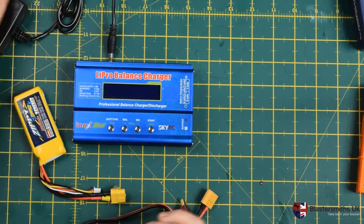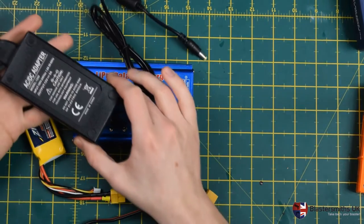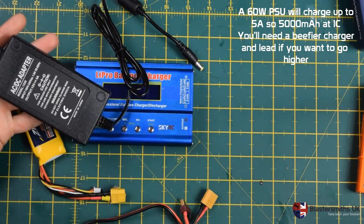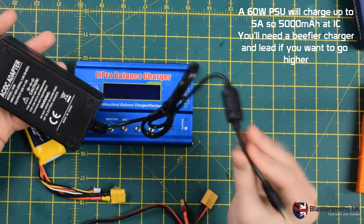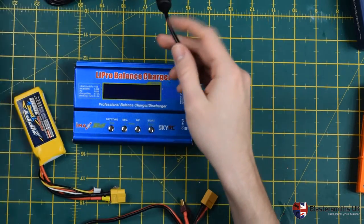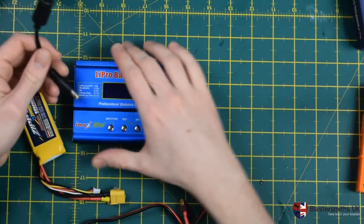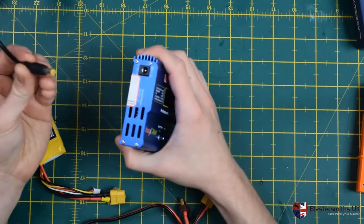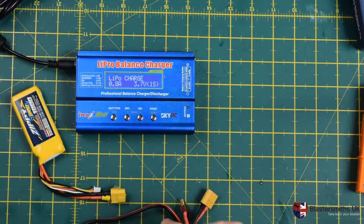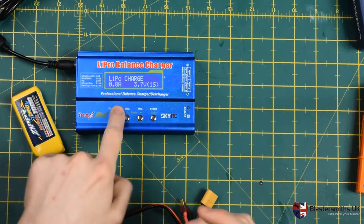To go with it you'll need, at a minimum, a 60 watt, 12 volt, 5 amp power supply unit with a barrel plug on the end. Those are usually bought separately either from eBay or Hobby King. To power it up you bring the two together — this is already plugged into my main supply and this one's ready for LiPo.